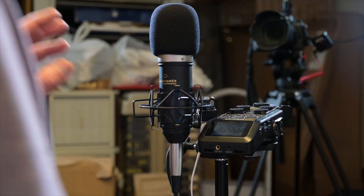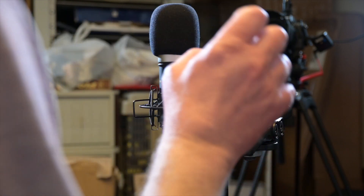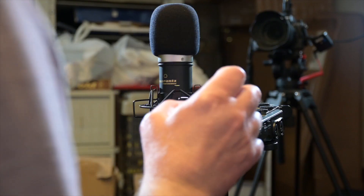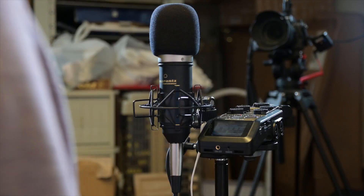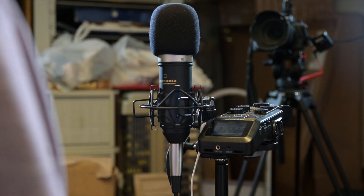I've got this microphone connected via an XLR cable going into my Zoom H6 recorder. It works with pretty much all recorders that take an XLR input. It also requires 48 volt phantom power, which the Zoom H6 can provide. I've got it going into channel one with 48 volt set on channel one, which is actually powering the microphone.